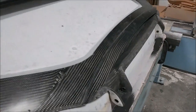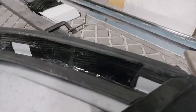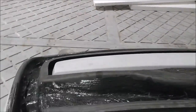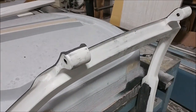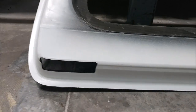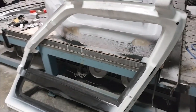Good progress on the door — it's all trimmed, holes are drilled for the hinge pins, and the door lock cutouts are all done. Next steps are drilling holes for the lock mounting hardware, adding cutouts for the lock actuators, and then closing out the backs of the locks. From the other side you can see the hinge bosses, the lock cutouts near the front of the window, and the three hook box cutouts on the bottom of the door — all these locks handle pressurization loads, with placement determined by Mark.